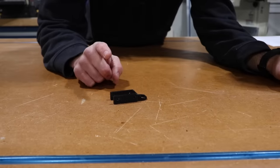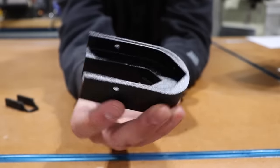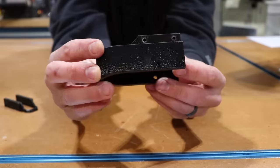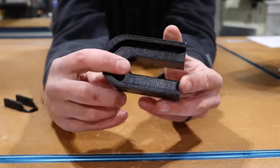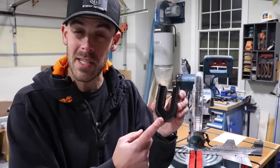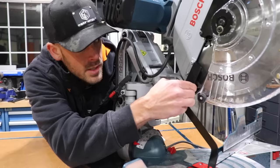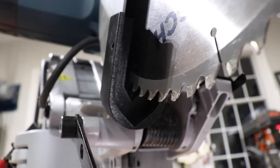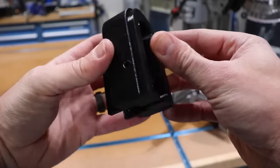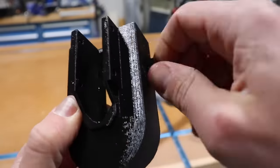I went back into CAD and turned this into a bracket that mounts to the saw itself and then accepts the attachment into a special recess on the bottom. The whole point is to make it quickly removable via two thumb screws on each side of the housing. With some internal self-centering geometry, taking the chute in and out should be quick and easy, leaving you with a really stable mounting place to attach the chute to.